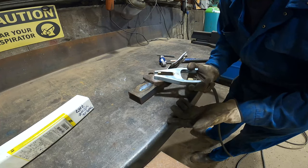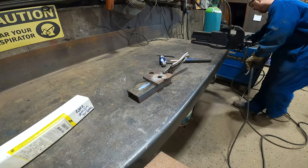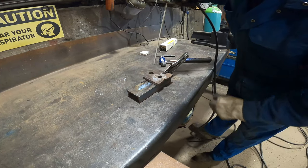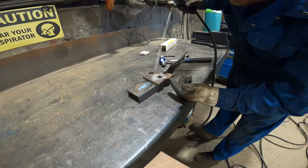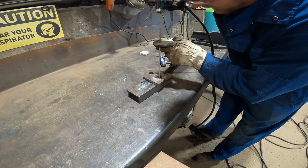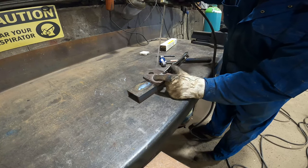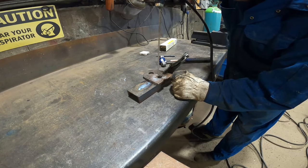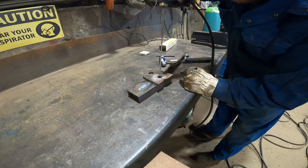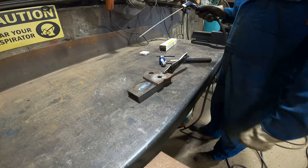I'm working on a workbench so I can ground out wherever I want, but if you want you can actually ground out to your clamp. When you strike your arc in there, it's really hard because it's such a tiny area to get a good match strike, but what you're going to do is start in the middle and do little circles, widening it out, staying about an eighth of an inch away from the edge of the template — because if you touch the template you're going to weld it to your pin. Just go around and around inside, and at the very end when you've got about the last inch to two inches of rod, burn it down in the middle to finish it off. That makes a nice little round cap and I find that works the best.